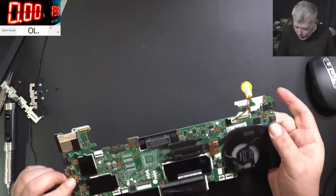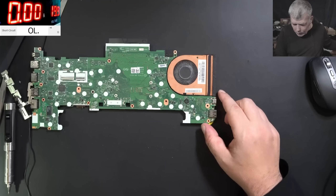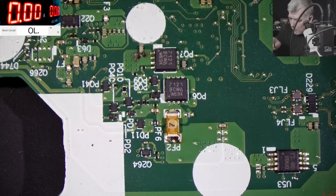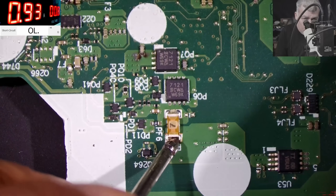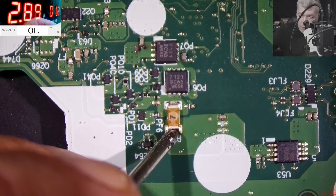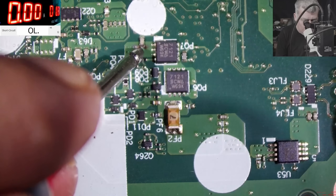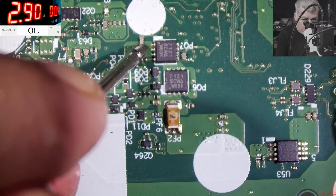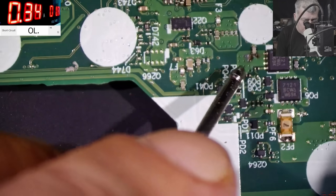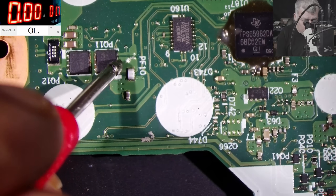The charging port is here and we also have a fuse. The fuse didn't get burned. Lower the voltage on the power supply — it's taking one amp. Let's raise the voltage — 1.2 amps. Here we have a fuse, then the first MOSFET, second MOSFET. After the second MOSFET we still have a short. But where is this track going? It's going here. Here is no short.